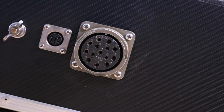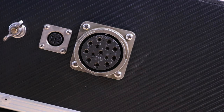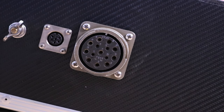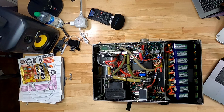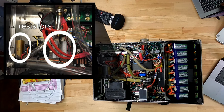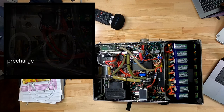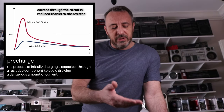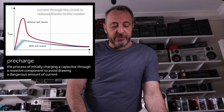The display gets 24 volts from the power supply, just like the UD3. The only other things in here are some resistors bolted down for the pre-charge, because you don't want to turn the battery directly onto an empty capacitor—it would pop the fuse or throw the breaker. So it's a soft-on: when you first turn it on, you'll hear a click after it's charged up through the resistors, and then it switches over to direct. That switchover is timed.